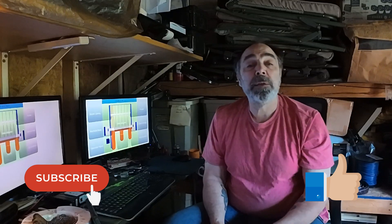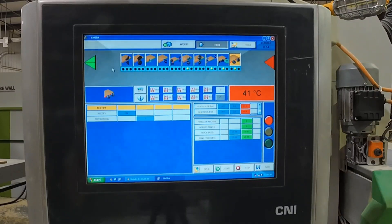Correct this first, make sure this is correct, and then go up into the parameters. As I said in the intro, you can correct the machine within the parameters, but if you do not confirm the mechanics, pneumatics, and things that tend to change over time first, then you go in and correct it with the parameters and in a short period of time the machine will start doing the same issues. There are times when the parameter adjustment is the correct thing to do, but you don't want to immediately jump into that. Make sure everything mechanically, electrically, and pneumatically is correct before you assume it's a parameter problem.